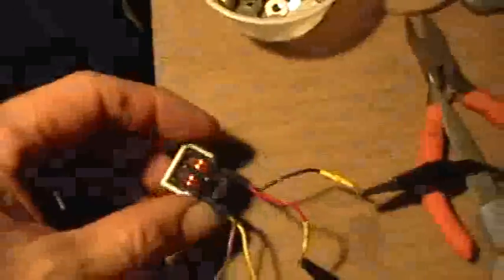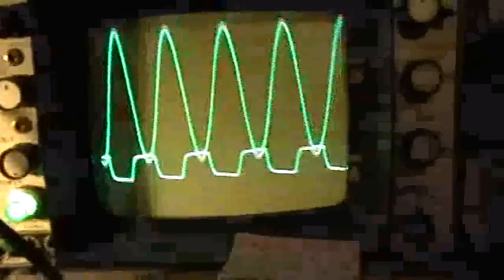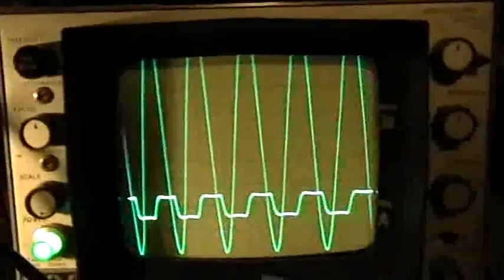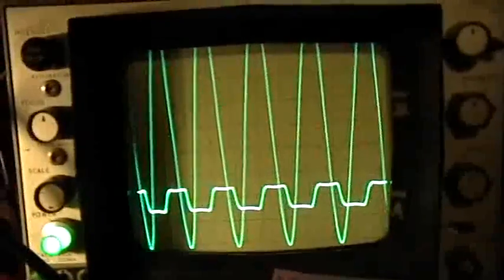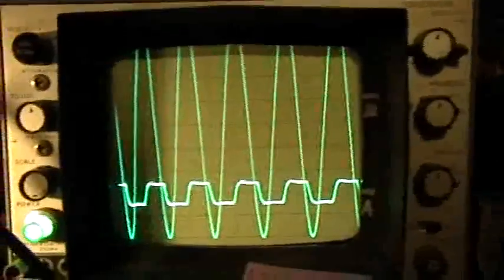So that's how you determine the resonant frequency of a coil. Drive one side with the function generator, monitor the other side with the oscilloscope, sweep the frequencies until you get a nice sinusoidal peak, and at the maximum output voltage, that's where you take your reading of the resonant frequency. Thank you for watching.